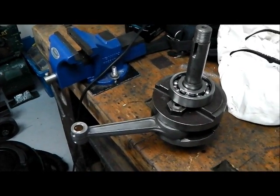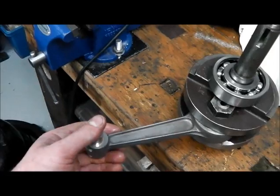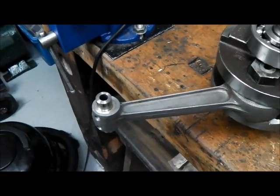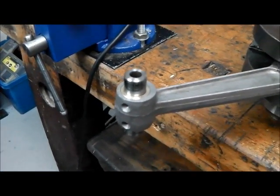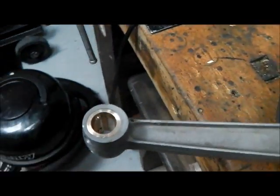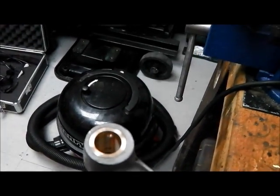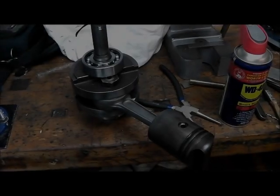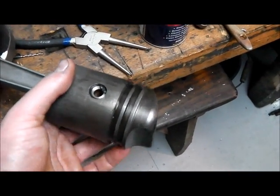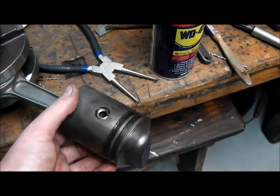Job done. The pin's a real nice fit in there — not tight but it just feels snug. I think that'll be alright. Finished off with the hand reamer, and just drilled the oil holes in it. The replacement pin is fitted now — perfect fit, feels really good. No unwanted movement, just all the right movement.